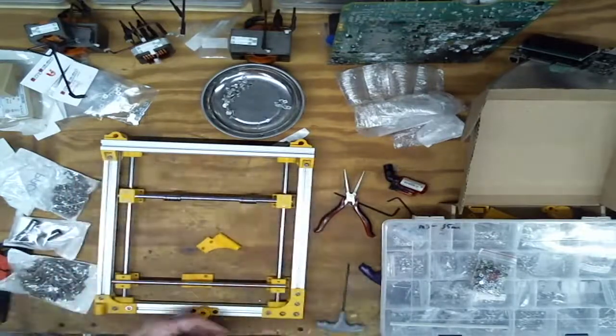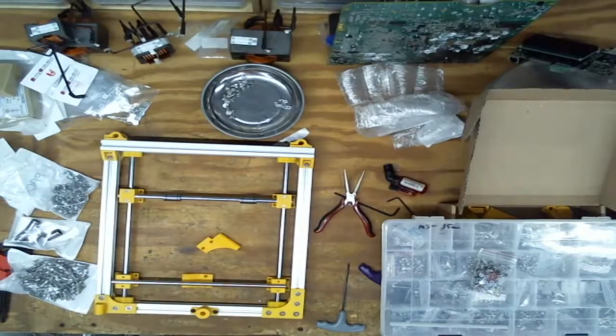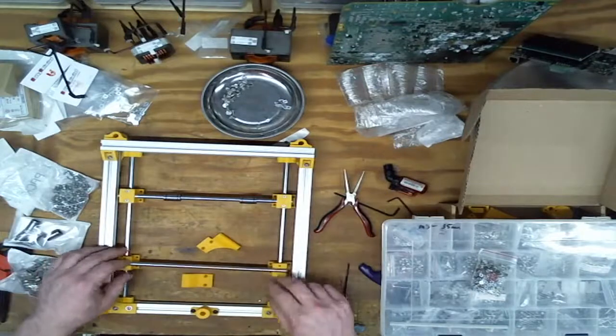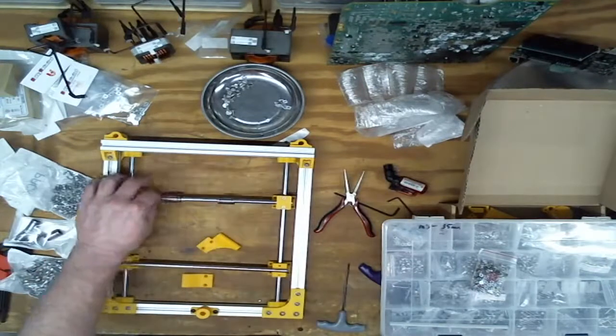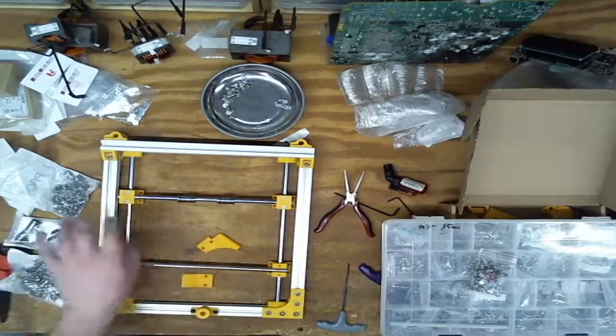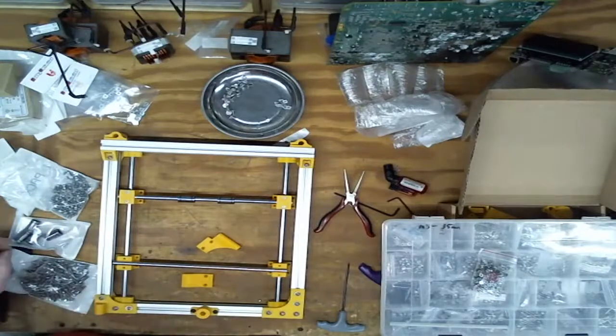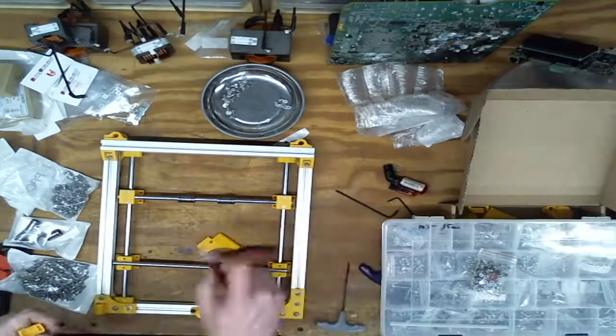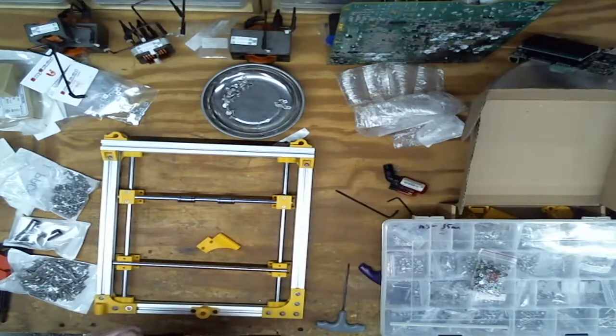Worse, I'm not greasing these bearings before I put them on. This is going to have such low usage and strain that the shipping grease will probably be good enough for a while, and then once it does run out and get gummy, I'm just going to switch over to sewing machine oil. So just lightly oil and run them back and forth, and that's usually good enough for a while. So before I put this guy on, I'm going to try and clean the stringies